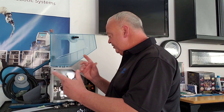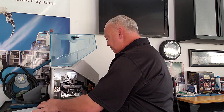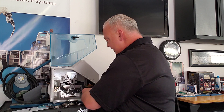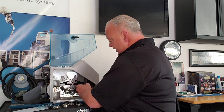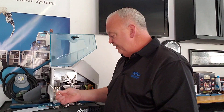Maybe put it in a plastic bag or the same shipping packaging that the aluminum kit came in, because when you want to go back to steel wire welding, you're going to want your steel kit readily available. I'll take my bottom retaining shield off, take my center guide out. The outlet guide is actually held in place — there's a groove in the outlet guide and a lever inside the wire feeder that holds it in place so it doesn't travel. I'll move my lever and push my outlet guide out.